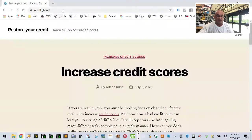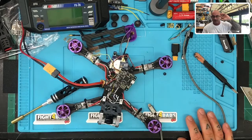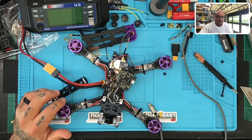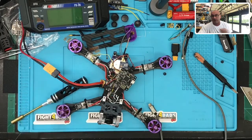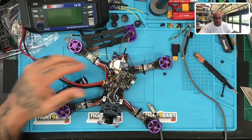This really sucks, because if you try to connect this board to BetaFlight or anything else, it's not going to work — it doesn't even come up with a COM port. You have to put it in DFU mode. What I ended up doing was loading Flight One to put it into DFU mode without using the boot pins, and from there I went to Cleanflight and flashed it.